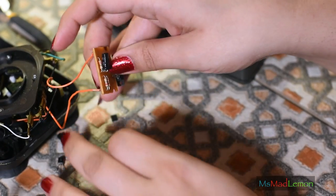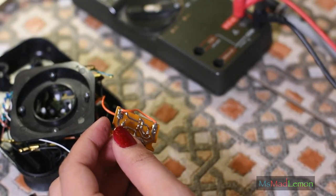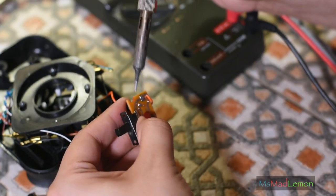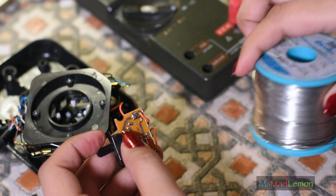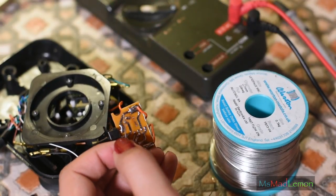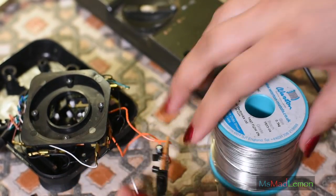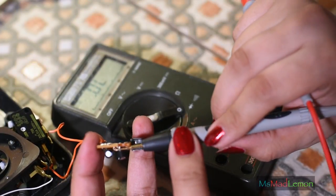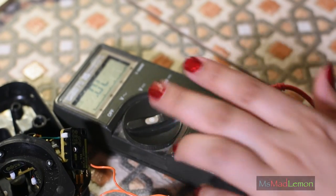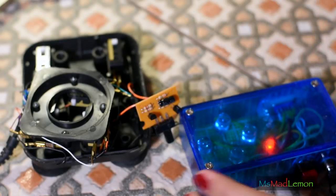Okay, so let's just solder these back in — properly soldering them in this time. Let's put the second one in. It's literally not a dry joint — it's actually not even been soldered. There was no bump there or anything, it was just a hole. I'm going to double check the continuity on these. Continuity on the emitter — should go to the emitter pad. Good. Continuity everything is fine — they're soldered in properly now. Very unusual problem.